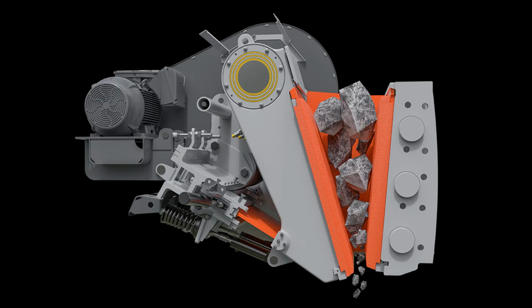Here is a cutaway illustration of a modern jaw crusher. You can see the larger material comes in at the top, and it gets crunched and leaves out the bottom as much smaller sizes. Basically what happens is the orange near vertical piece on the right doesn't move, but the more slanted piece on the left does move. It moves in an elliptical motion, and as it continues to move, it pinches the rocks and allows them to be broken, pulls apart slightly, allows them to slip down, and then pinches together and breaks the rocks in a continuous cycle of shifting back and forth to crush them down.